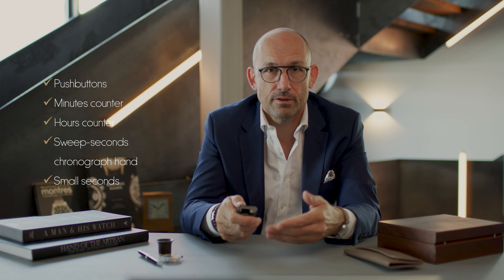Let's see what the distinctive features are that all chronographs more or less share. The first one is the push buttons — to start measuring you need to activate this added mechanism, and you can see them in white here. Then you have to count the minutes, so there is a minute counter. There might also be an hour counter, which is optional. Then you have the sweep second that is actually measuring the chronograph seconds. Then you have the small seconds of your watch, which is just there to count the time of the watch. Then you have a graduated scale where you can actually measure the time.